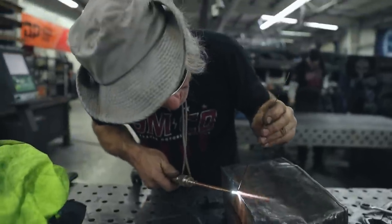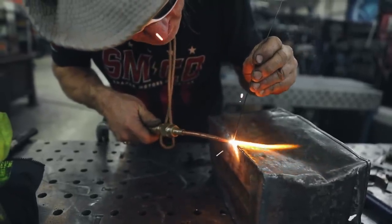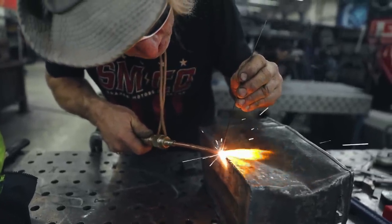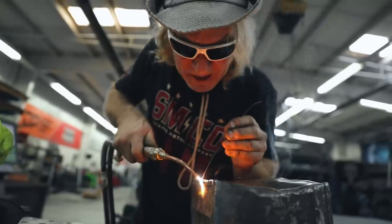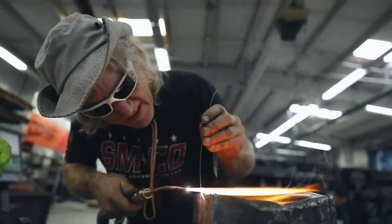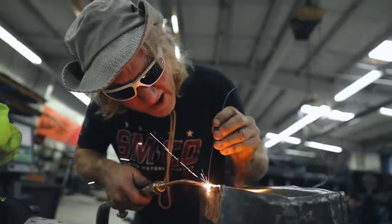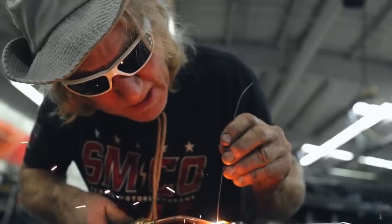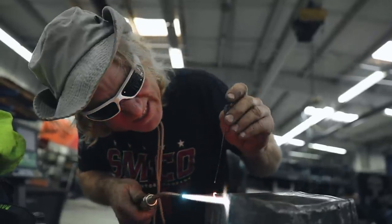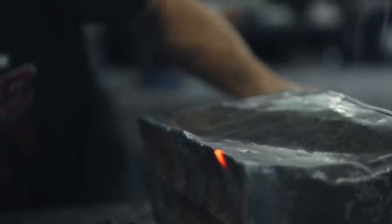And oxyacetylene is actually superior in some ways to the new modern welders, because I can do stuff with the torch that you can't do with the machines. I can heat up localized areas without penetration, or I can penetrate, or I can weld with anything: wire, bolts, nuts, baseball cards, a sack of marbles, pieces of metal that's just been left over. May not be as clean as a lot of the machines.